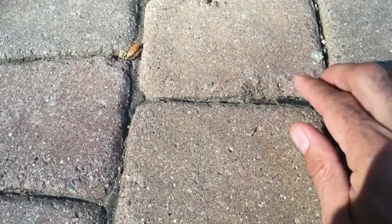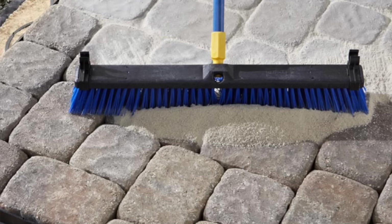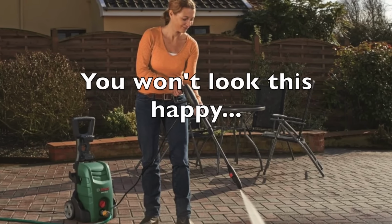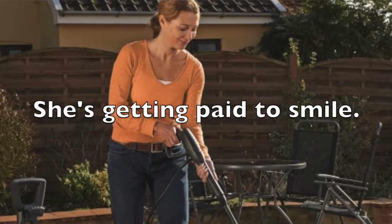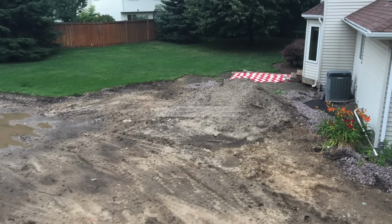Now, paver patios have a certain element of maintenance regardless, but you can freshen up standard sand compounds by grabbing a bag of sand and sweeping it in and hosing it off every year. It takes you 30-40 minutes at the tops. If your polymeric sand breaks up, you've got to remove all of the polymeric sand and start all over again. It's a higher level of maintenance down the road. It's your choice. Hope these techniques have helped you to understand a little bit better what the most important element is when you're installing your own paver patio.